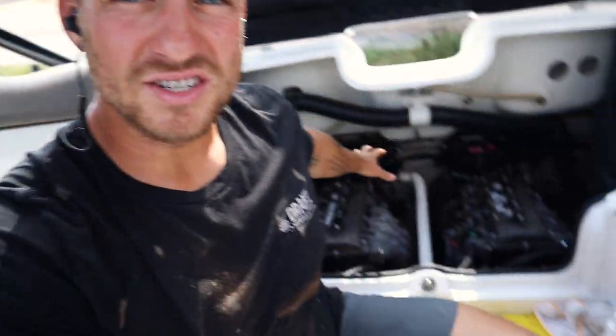This is a super simple process — just cleaning out the area and getting the motors looking good. It doesn't take a ton of work. The only thing different is if it's extremely oily or dirty — you just have to use more Super Clean, or even use it straight to really eat at heavy grease. Other than that, do everything exactly the same. You don't really need any more tools for engine rooms. Same kind of process on bigger boats, just a larger scale. I hope this showed you how easy it is — it's not rocket science. Please hit the like button, subscribe, and hit that bell notification so my videos pop up every time.